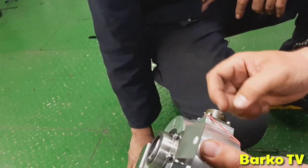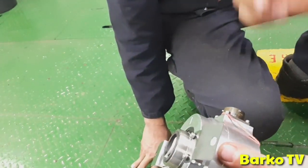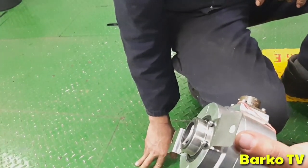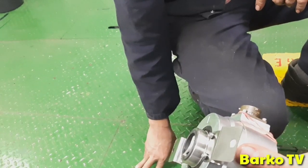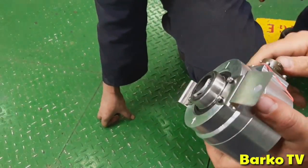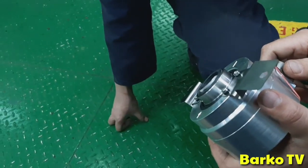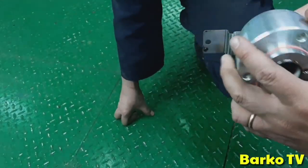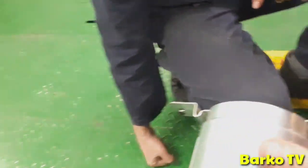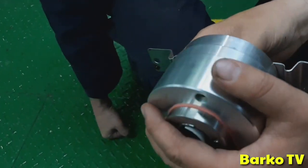It's very easy for you. You can unplug it, because it's a plug. So if you do it like that, you can work with it. But if it's with a cable, you must pull the J1 power plug on ECU-A, because otherwise you make a short circuit down here. Tacho system A belongs to ECU-A. It's here. Tacho system B belongs to ECU-B.